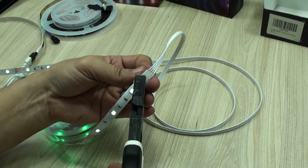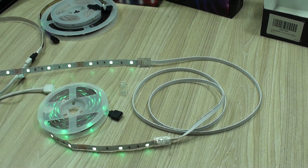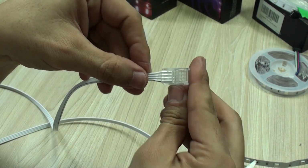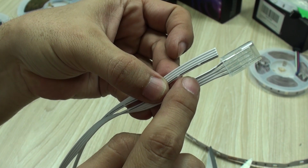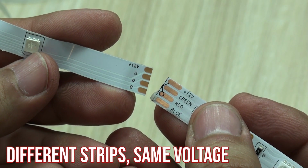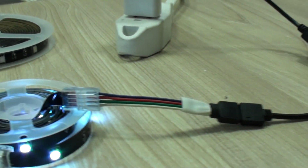I immediately had the result I expected. They came on without having to reconnect or check the connector installation. The only time that I had to do this is because I was not careful enough to check the polarity of the extension wire, which is conveniently marked at one of the contacts, which can be a 5, 12 or 24 volt positive cable. The other ones are left for the RGB negatives.